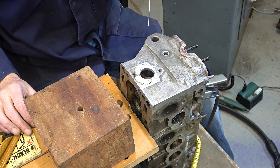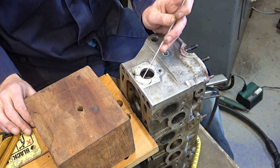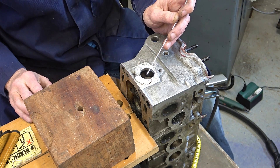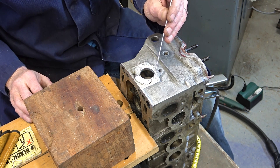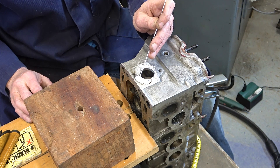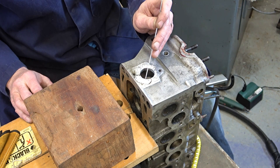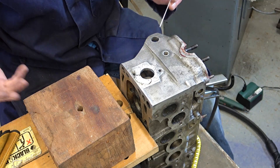I can see a few mistakes I was making. Particularly I was pulling the rod out of the gas shield and contaminating the work, so I need to keep it much closer. Also I'm going to go to this thinner rod. Where I was working here with a deep hole like this, I'm sure I've created a cavity — it looks fine from the surface but I think when I machine it I'll find a hole. But it's going better than I expected. I didn't melt through this edge here, so I'm going to keep going and work my way around.